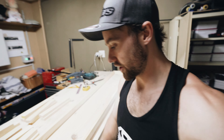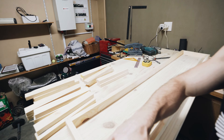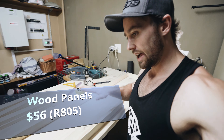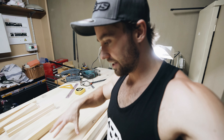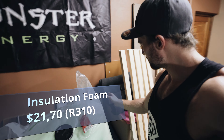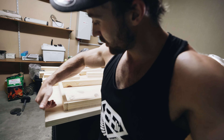So to show you really quickly how this is going to work — these little end pieces, you can see a whole lot of them here. They make up the top and the bottom of what are going to be our frame. So this is one frame, and then these are what we're going to use to pull the carpet around. We are going to pull the carpet around these frames, and on the inside of these frames we are going to have this insulation foam. This insulation foam combined with the carpet should give us very, very good noise control, especially in the corners. We're actually going to sand these rough edges off, screw into there, and then we should have a good frame, and from there we can begin staple-gunning the carpet onto these.